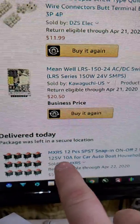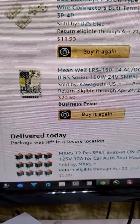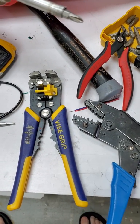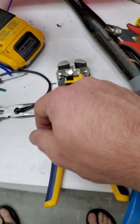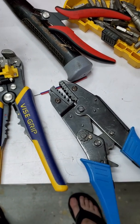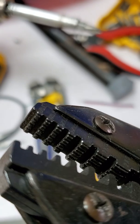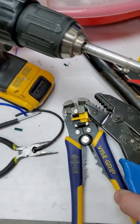Here we have the switches — I'll get to the location where I put those on my machine. If you have the new machines with the seven-pin connectors, the old switch where the rotary used to turn on and off — you can put it in that location, which is what I tend to do. Some other tools you're going to need: side cuts or flush cuts, a pair of wire strippers, needle nose or diagonal cutters, and a crimper tool to crimp your connectors. You can use needle nose pliers but the crimper gives it texture with little teeth and dimples, which makes for a much better crimp.